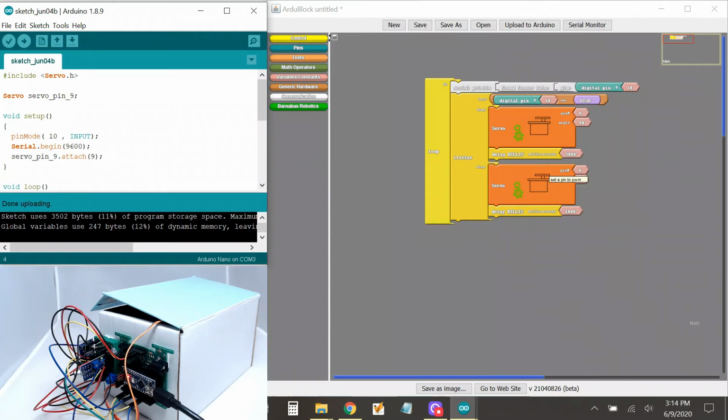And it's gonna do this and then delay 1000. So if it doesn't hear anything, it's gonna close, delay 1000. Close, delay 1000. The problem now is the amount of time that it's spending listening for sound is so little now. So we actually have to move this away. So this delay helps us on one hand, but then hurts us on the other hand. So this is a tough problem. Okay, so let me upload here.